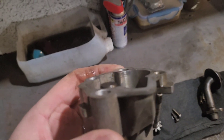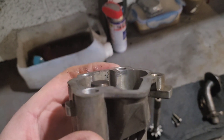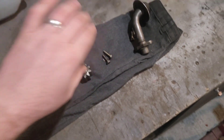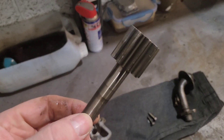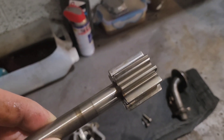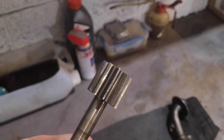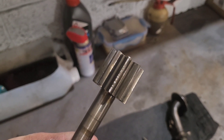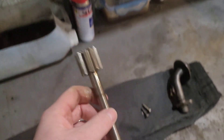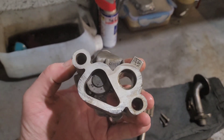All those horizontal lines and that bit there - that is the gear touching the housing, which it shouldn't do, because it's making contact and bits are going to wear off. You can see some bits of crud in there as well. As soon as that starts wearing down it's going to cause drag, and it's going to damage the ends of these teeth. You can see the matching lines on the shaft where it's been making contact with the body - so either the shaft isn't machined right or the hole isn't. Either way, they're not matching, they're not perfect.